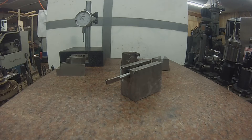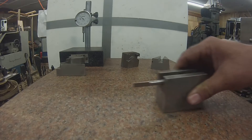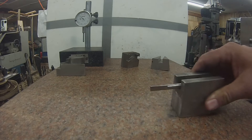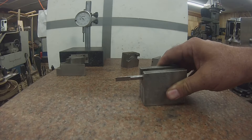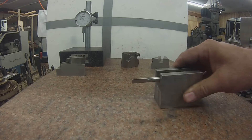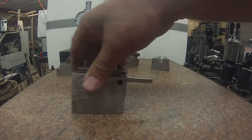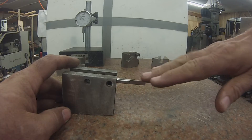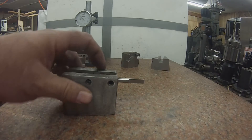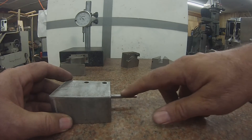So the lead man on the job, he designed a block like this, and this has all the angles built in. We had a big — like a 36-inch planer and an 18-inch planer. He could clamp this on the table, turn the magnet on, run the wheel in, and put all the cutting edges in. With the planer, he didn't need a tool and cutter grinder — it had all the clearances built in.